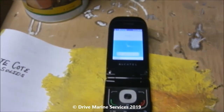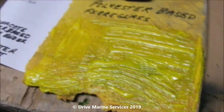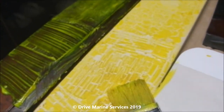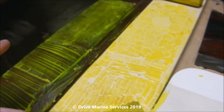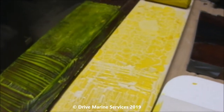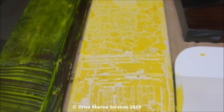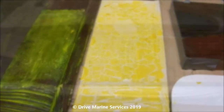We've had the paint stripper on there for about six minutes now. I've applied it by brush and by roller, and I think you're better off applying it by roller because you get a more even surface. When you apply it by brush it'll eat away faster at the thicker areas and the thinner areas won't be as effective, whereas a more even coat with the roller works more effectively. You can already see the top layer has been lifted on the two single pack paints, the varnish and the paint — we'll leave it a little bit longer, but that top layer will scrape off now.